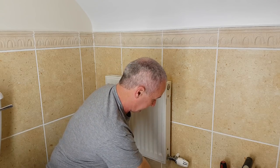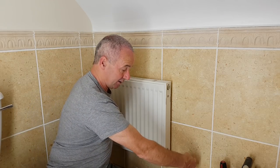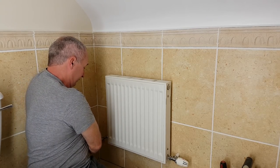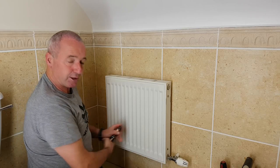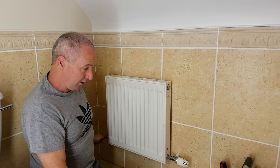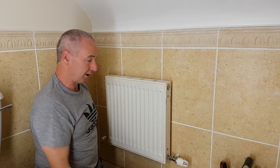I got a small amount of water out — it didn't go through the towel. Dry off the radiator, then open the valves and make sure everything is okay. The thermostatic valve is open, and on the return end, open it all the way and then come back just a little bit. That way, the next time someone touches it they'll know it's not fully closed or fully opened — if it's fully open and you try to open it more, you'll snap the stem.